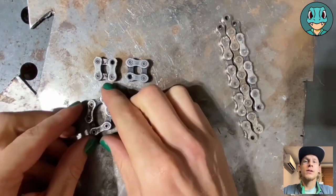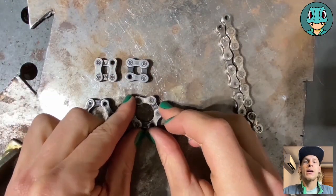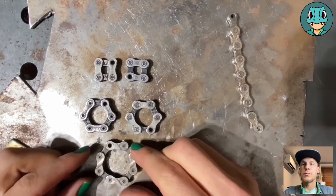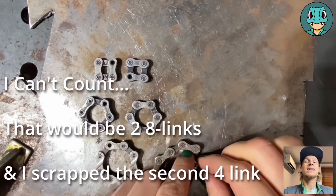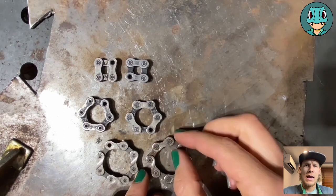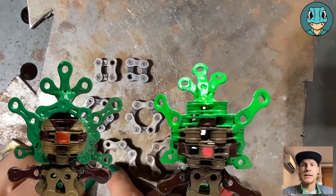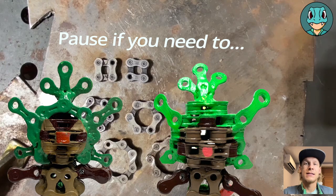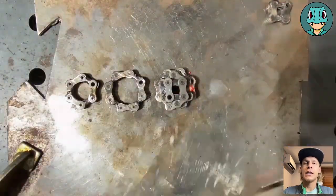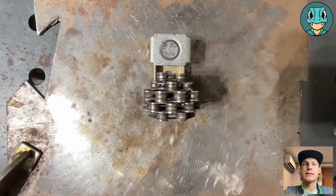To start out for the head, we're going to be using two square four-links, which will be the top and the bottom of the head, two sixes which will make up the sandwiching layers, and then three eights which are going to make up the middle portion of the head. This is significantly different than the original design I did, where I tried to do the cap and the head separate, and it just straight up did not work out very well. As you can see, the new design is significantly better. Now to stack them and tack them, we pretty much just add a quick tack on each side as we build the head up, stacking the descending link sizes.